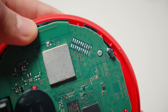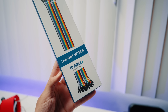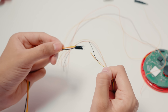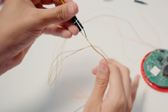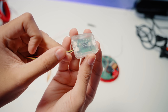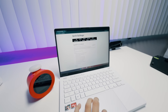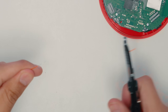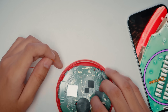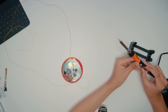Here's the game plan. First, we're going to use some 30-gauge wire and solder three points to the board. From there, we're going to use some Dupont wires — think of them basically as just extension cords — so we have an actual connection to plug our solder points to anything. From there, we'll plug those into a debug cable, which we can then plug into a Raspberry Pi debug probe, which we can then plug into a PC to finally start messing with it. This seems like a lot, but it'll make sense once you see it all finished up. I'm going to prep the wires by stripping them first and then putting on some tape to make sure they don't move when I'm soldering.